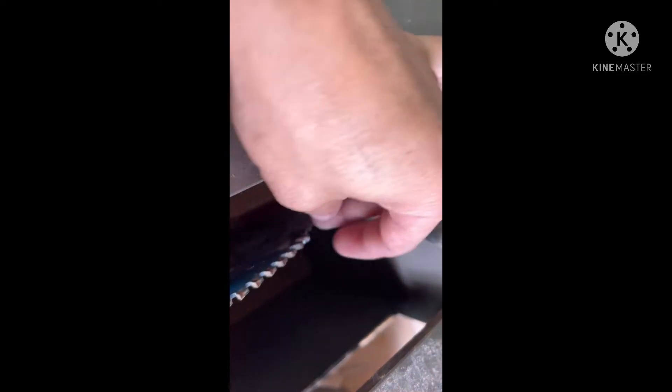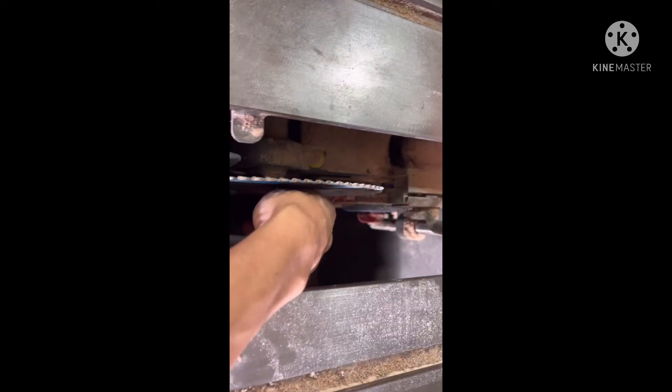When you burn your disc, don't let it heat up because it'll crack. It set my brake off, so in order to remove the brake we already unloosen this right here with our wrench, and then we're unscrewing — you gotta unscrew the nut that goes onto your arbor arm and then remove the disc. Make sure it's not stuck.